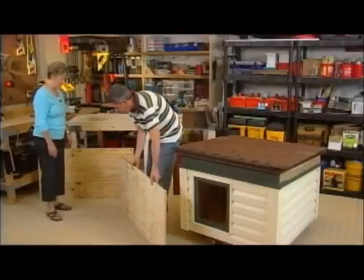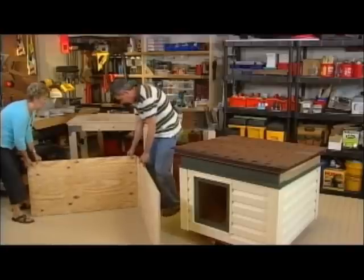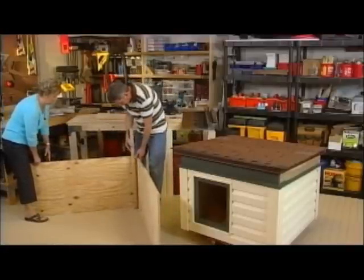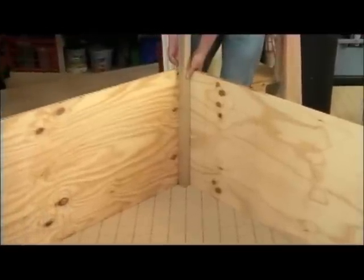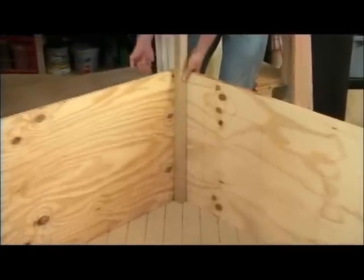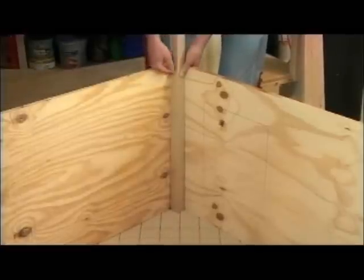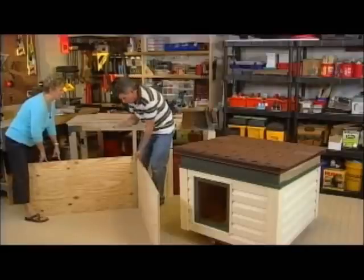Once that's done, you want to start the assembly. I cut my other panels with a circular saw. The key to the whole thing are these corner posts — just little two-by-two posts that you cut down to size using your miter saw. Then I just attached it by screwing from the outside into the post, using galvanized screws so that it will be weather tight and won't rust.